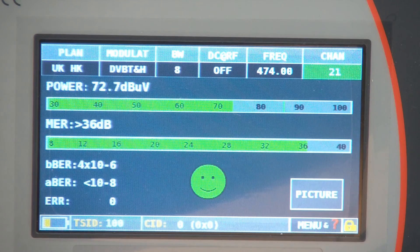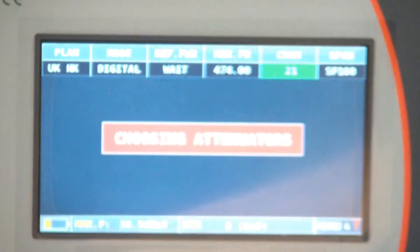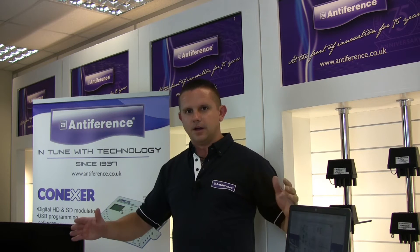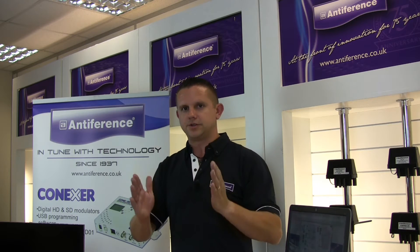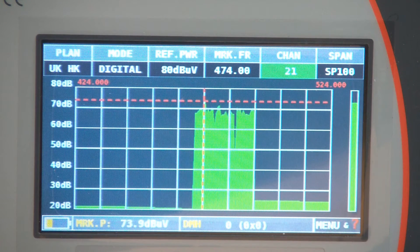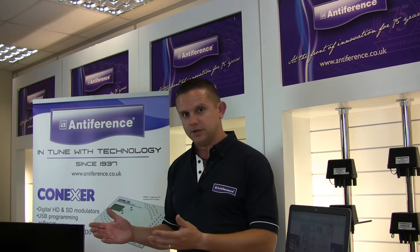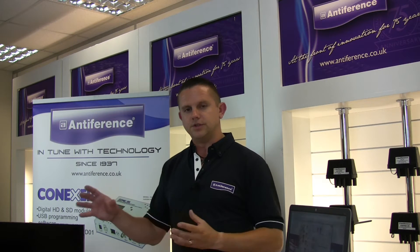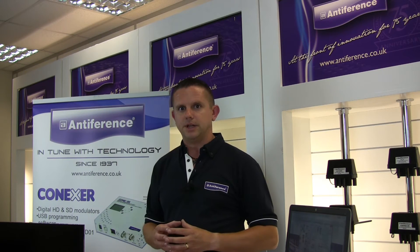Let's have a look at the spectrum as well. We can see the MUX in its raw form on the spectrum analyser. What we're looking for is a fairly well-defined box shape with a wavy top. Sometimes a multiplex will have a big tail-off — the shape needs to be nice and uniformly square. That's a good quality signal coming through. The noise floor is nice and low on either side, so we're happy with that. If you're getting poor signal quality it could be your amplifier causing the problem, so it's worth going through each component, removing them from the system to identify which one is causing the issue.